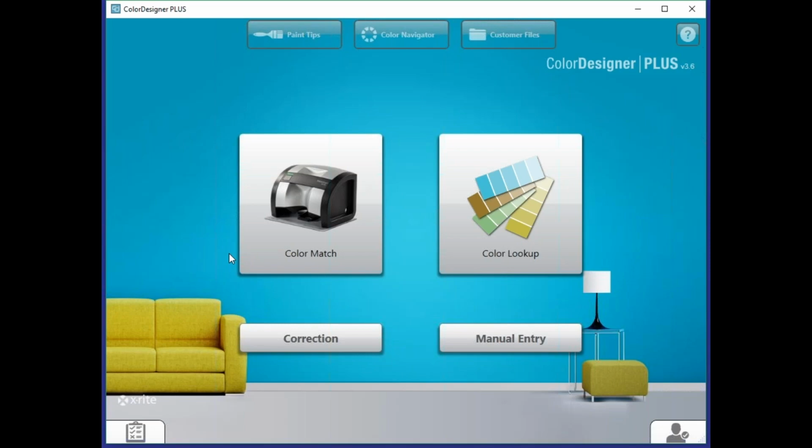Use the alcohol wipes. With the MetaVue or the iVue, we send Bausch and Lomb alcohol wipes, individual packets with each instrument. If you run out of those, you can go to your CVS or your Walgreens and just buy lens wipes. That's what we want to use. Stay away from Sparkle and Windex because they like to use dyes, and those dyes can actually stay on the calibration plaques and the lenses, and we really don't want to have any of that. So use the alcohol wipes. Great question there.